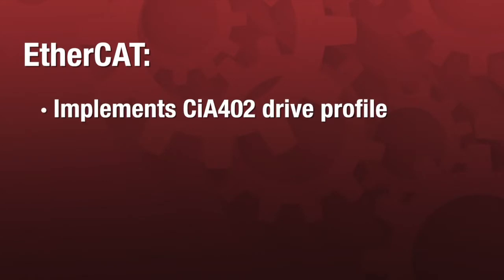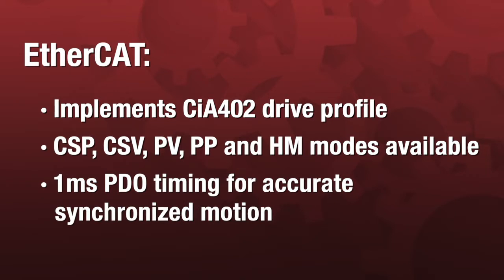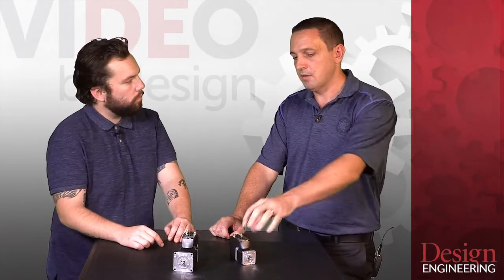The next step is the integrating of the EtherCAT. EtherCAT is a very robust high-speed protocol that gives you a lot of flexibility in dynamic motion. You can update up to 100 axes at 10 kilohertz — that would be 100 microseconds each — just being able to change your motion dependent on different things going on within your machine. With EtherCAT, you're running your power and your ethernet cables. On the integrated design in particular, we also have our I/O right there, so if you've got an I/O point close to a particular axis, it can be wired directly into the motor and still accessed over the EtherCAT protocol.